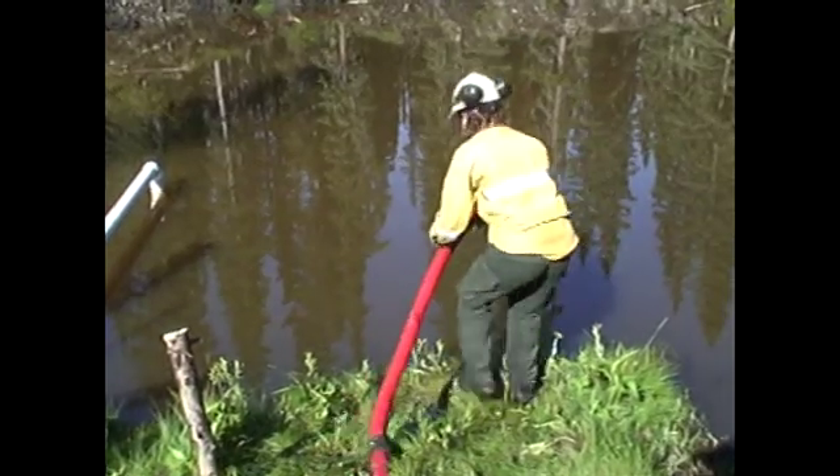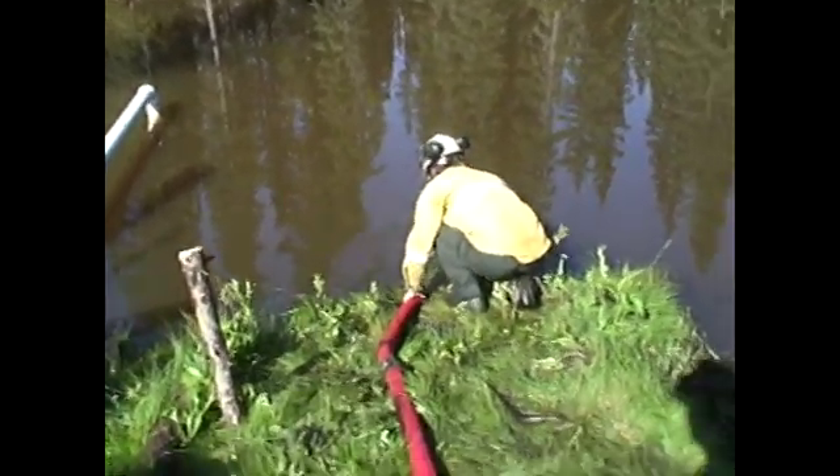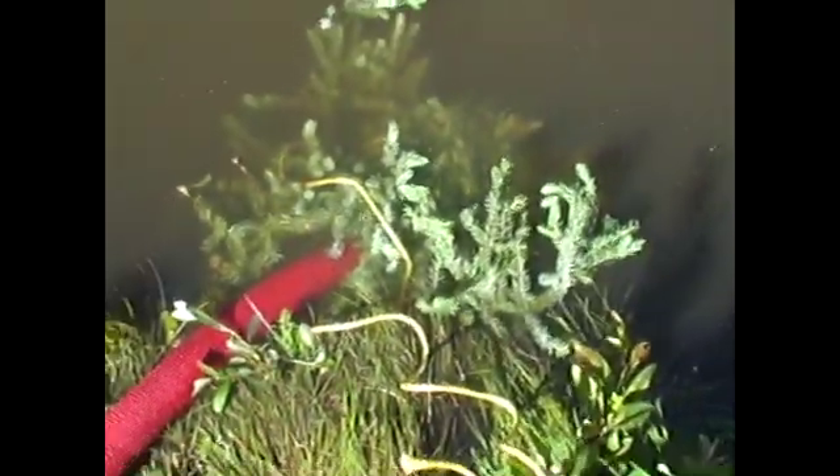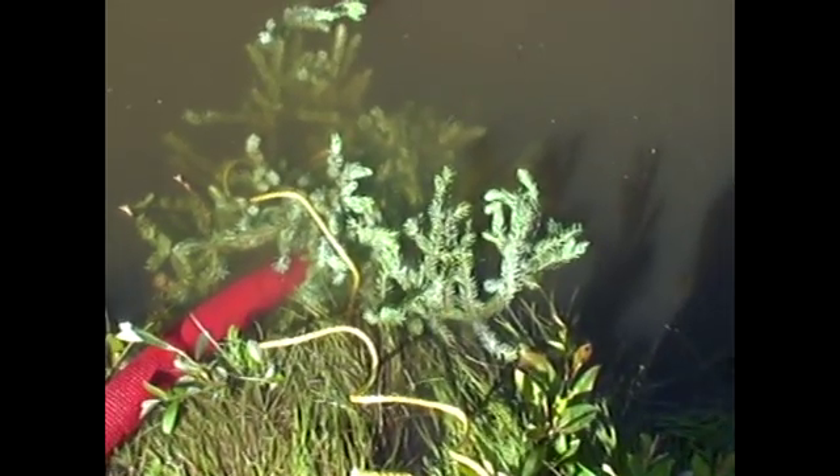Normally in these sites, once you've got the foot valve placed into the water source, you're gonna end up priming through the primer cap to make sure that you're not disturbing it. Perfect little setup there — foot valve well protected, suspended off the bottom and deep enough.